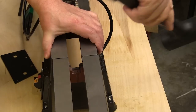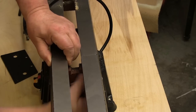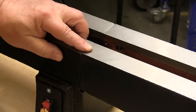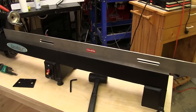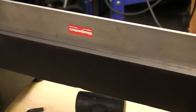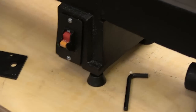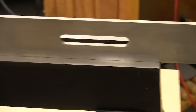With both bolts installed and snugged down, we need to align the ways, and we want to take a lot of care in getting this right. We need the middle edges perfectly aligned and the ways have to be perfectly flush with each other. This is liable to take a little back and forth with a dead blow mallet, but take your time and get it right. The ground surfaces of the ways have to be perfectly flush to make sure the tailstock slides through the joint easily. To make sure the center is lined up, put a good straight edge down the ways across both pieces of the bed. I found a tiny gap beneath the straight edge right at the joint — the feet in the center of the original lathe were actually suspended a little bit, so I turned both middle feet down to make sure they were carrying weight, and the gap went away.